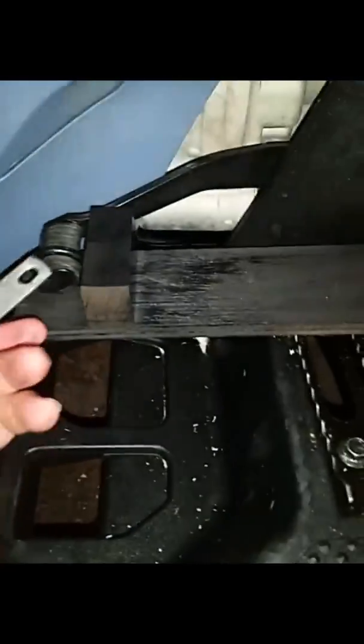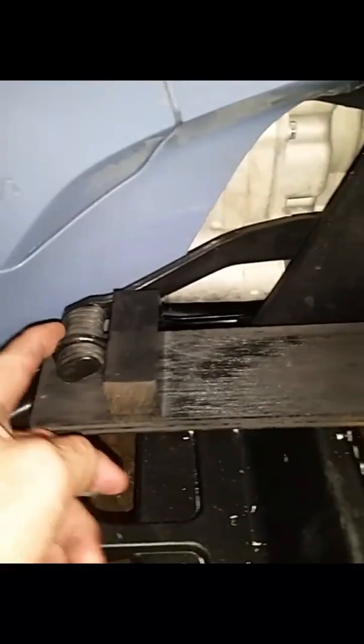The terry cloth is going to rub the thing, and now we're going to put our painted U-bolt on. And don't forget to put this little bracket that comes with the U-bolt, to help keep the wood from splitting. Okay, so I got the U-bolt bolted. Don't forget, you got to put silicone or some kind of glue in your threads. You're not going to tighten up this bolt dead tight. You're going to leave it a little snug because it's going to split all your rubber here. Unless you got lock washers with the nylon Teflon on it, or you just put some glue on the bottom of the thread so that you won't lose your nut.